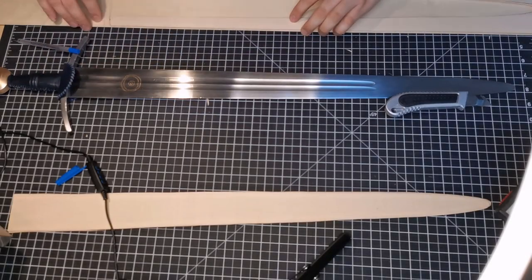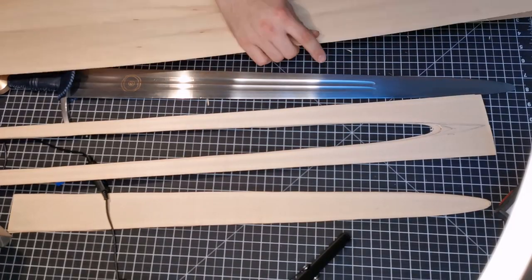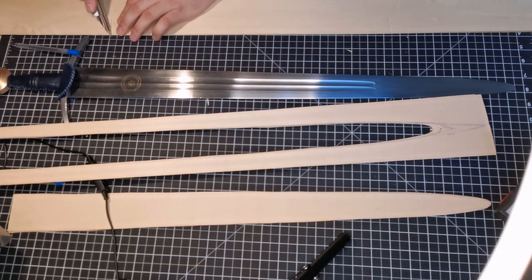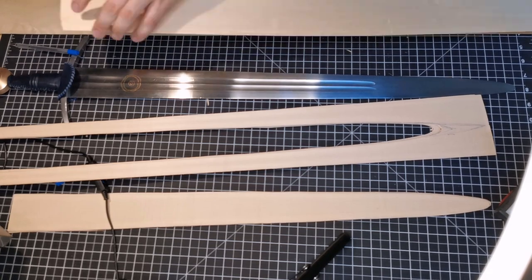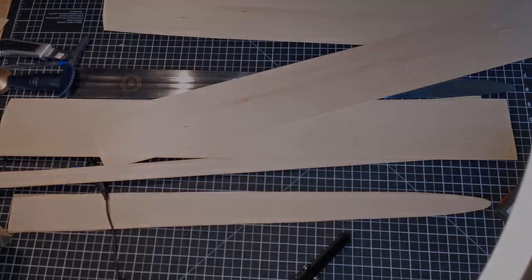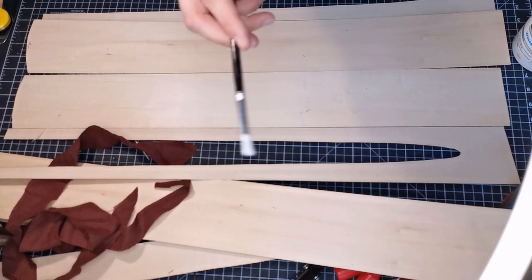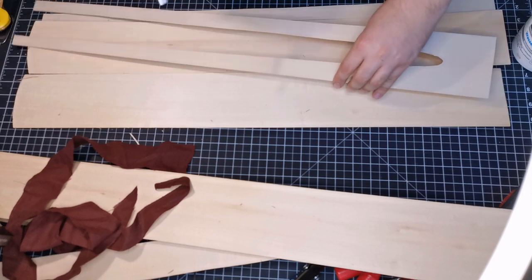The next step will be cutting two outside boards into the same length. After making sure everything fits, I used wood glue to glue each center board to an outside board, still leaving two pieces in total.